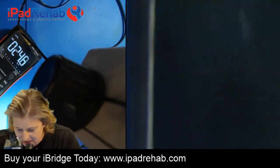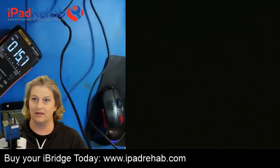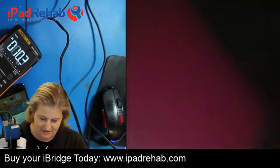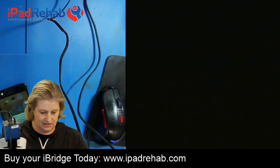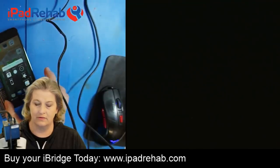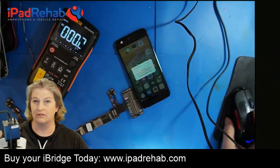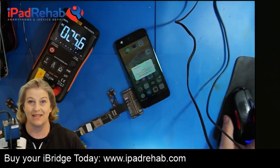It's booted all the way up. I don't know if you guys can see that or not. Maybe not under the microscope. There we go. You see that? Touch works. It's dimmed down a little bit because the proximity sensor isn't attached. But there we go, we have this booting up with image, and our normal voltage has been restored, which means we will also have our normal voltage at everything else connected to that 1V8 image line, which before we had no idea about, and now we know.